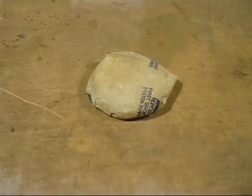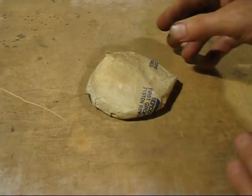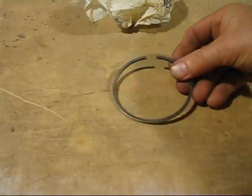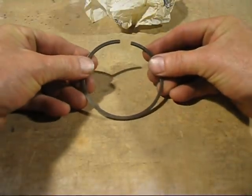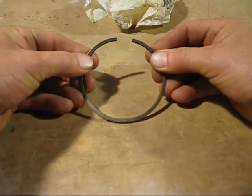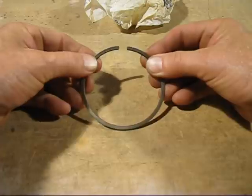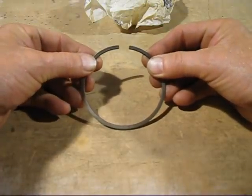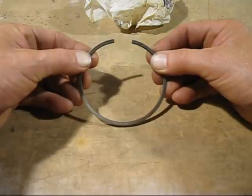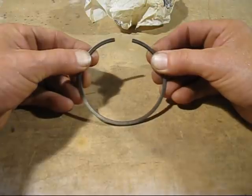Here's another interesting point about pressure testing castings: they do stretch. The higher the pressure, the more they'll stretch. I'll demonstrate that with this brand new piston ring. You'll see that stretches — because it's very thin and not connecting at the end, it's stretching a lot more than it would. But when you pressurise a casting, it will go out like that and it will fail. That's probably not the only place it'll fail — those threads are another weak point as well.